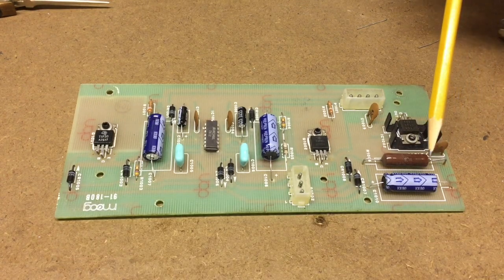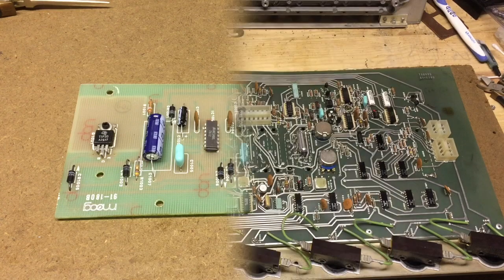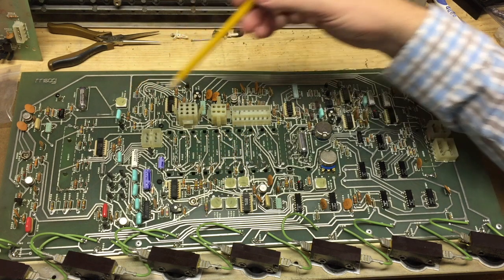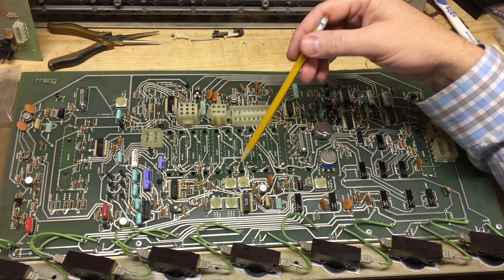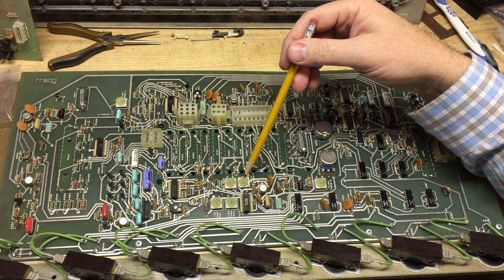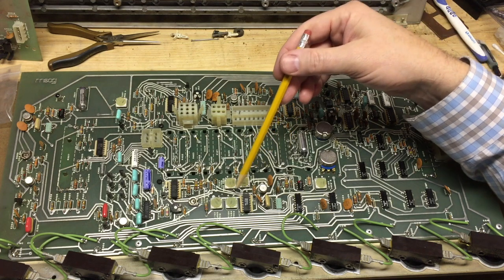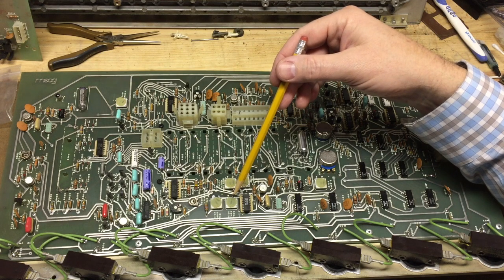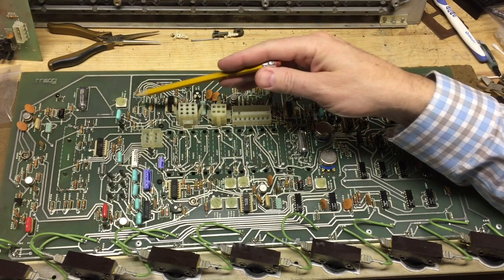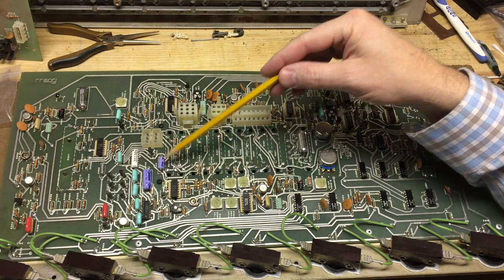So far I've replaced five electrolytic capacitors in this power supply circuit board. Now that we're done with that, let's go over to the main circuit board. What we're going to do here is replace six of these integrated circuit variable resistors with new CERMET variable resistors, as well as a fixed resistor in series with each one. Now each of these things right now is actually two things in one — it's a variable resistor in series with a fixed resistor. So when we replace it, we're going to have to replace it with two things, except for one that only has the variable component — the fixed resistor portion isn't actually hooked up to anything. For five of them we're going to replace those with two items, this one with one item, and we're also going to replace these two electrolytic capacitors.